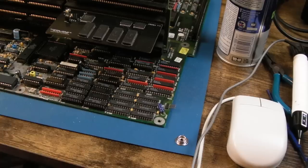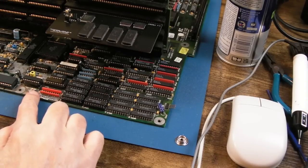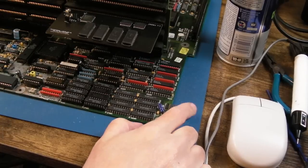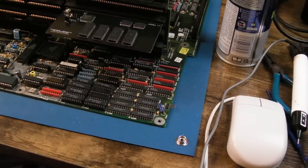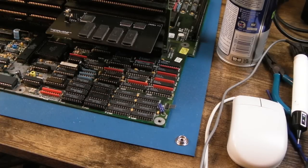Yeah, we're going to get the same thing with the SCSI LED, but anyway, the main thing is the connection from here just needs securing and fixing a bit better. That goes to the SCSI point there. I've tested the resistors here, and these are for providing the connections to the LEDs, and everything's there. Yeah, the resistors are alright, and the connections between here and the 07 are okay.